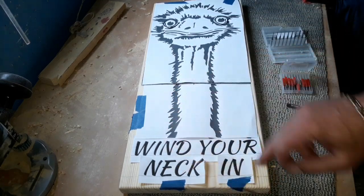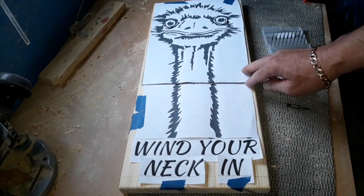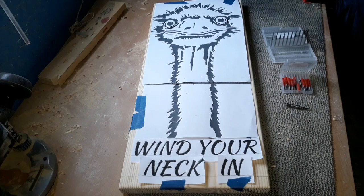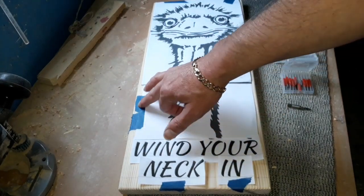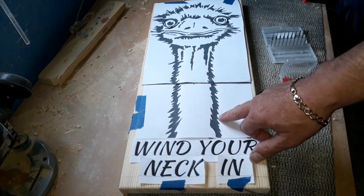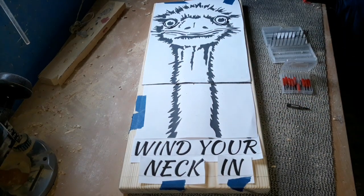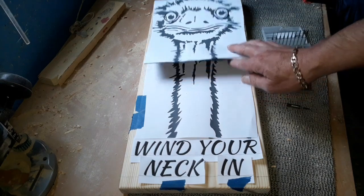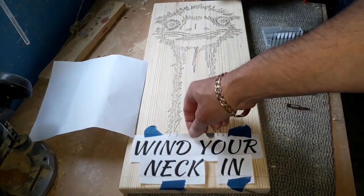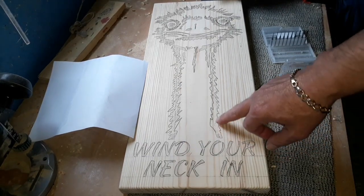The saw's down, stuck in place, we've marked out where everything wants to be — it's nice and square, everything's sorted. The way I do it, as always, is literally put your carbon paper underneath and draw around it. That's as simple as it gets. If you're really clever you can put some painters tape on the full piece, spray it, stick the wood right down and route over the top — but I've tried it and it's just a mess for me. So good old carbon paper, draw around it as always, and you can see what we've ended up with.